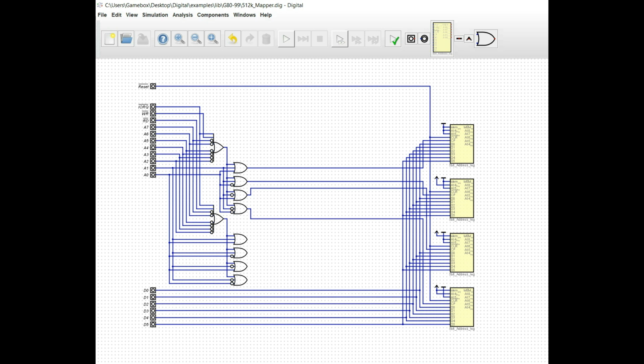Okay, so now we're going to construct a circuit that's going to allow us to actually read the data from these address bits here. And that's going to help us out a lot because, like I said before, we are going to want to make sure that we can read this data for purposes of reference. So in case we are trying to remember which area of memory we were addressing within the computer software, we can read that register, find out what it is, store that value either in an internal register to the CPU or in another place in memory, and then refer back to it at a later time. So we're going to go ahead and start constructing that second order of inputs here, and we are going to expand this system piece by piece.